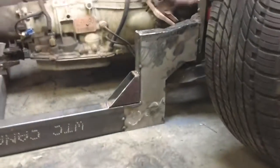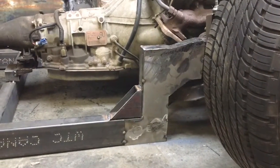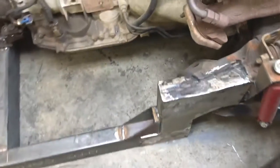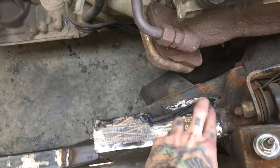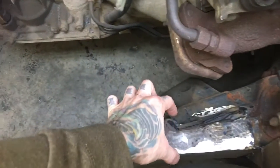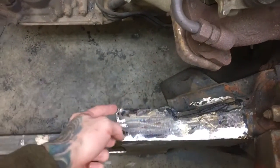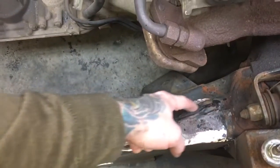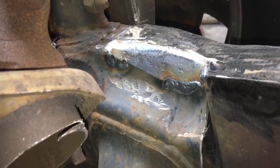Here's the before — that's the other side I haven't got to yet. And here's the after: it's all one big plate in there now, and there's the gusset. Here's the piece I used to cap it all the way up — one long piece that came in and went around the top. I welded all this, ground it down, smoothed it out, and then I heated this line right here and pounded that down in there.